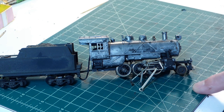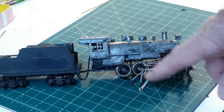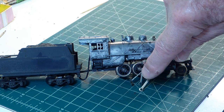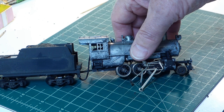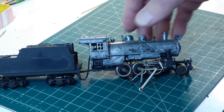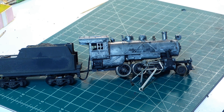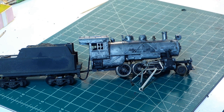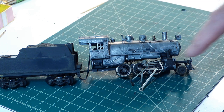So in this video - and in that first video, after I took the paint off, I said to wait for warmer weather to go out in the garage and hit it with the rattle can. Well, here's two years later, and probably because of what happened with the connecting rods, I put it up on a shelf and forgot about it. Now I've pulled it down. We're going to fix that, take this shell off, put it into some lacquer thinner to get the last remnants off, scrub it good, then paint it and letter it and show you that it's a good runner again.